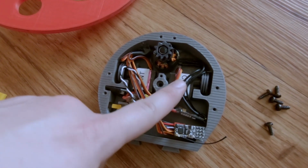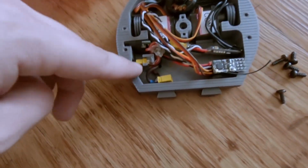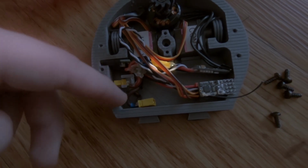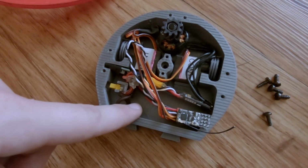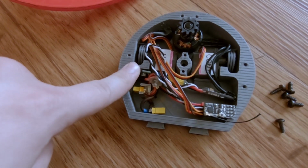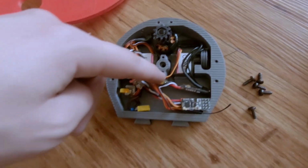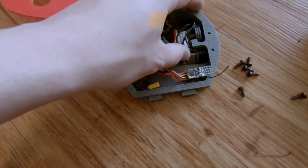After finishing all of this, I plugged in the battery, popped in the link, and smoke poured out of all of my wiring. I had soldered the ESC's XT30 on backwards. What a facepalm moment. After that, the LiPo was reading as under 2 volts, so it's definitely toast, and the ESC was dead too. I had to solder a new ESC to the motor in XT30 correctly this time, after which everything worked as expected, and I got the robot into the test box. The spare battery I grabbed was only at 60% storage charge.